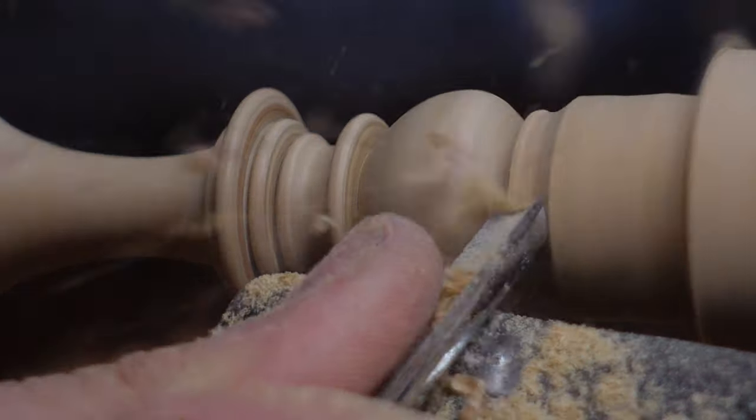For great results in finishing, I coat the piece in Danish oil and leave for at least a week before buffing and polishing with three different hard wax compounds: Tripoli, White Diamond and Carnauba. The wheels are made from cotton, a blend of cotton and linen, and pure linen respectively, with the equivalent grit getting finer through the process.